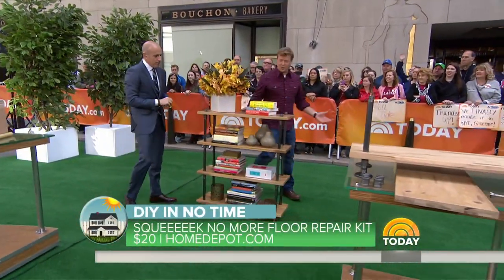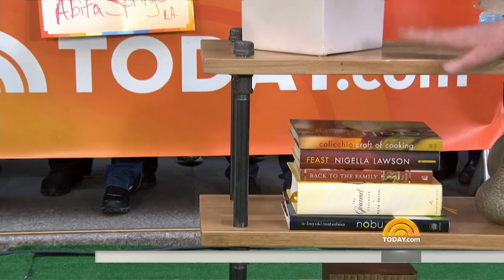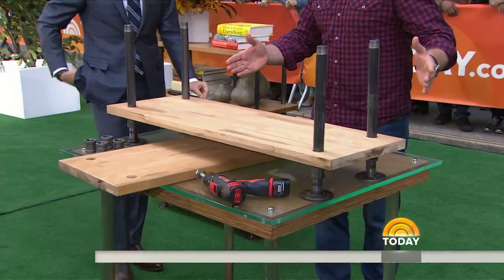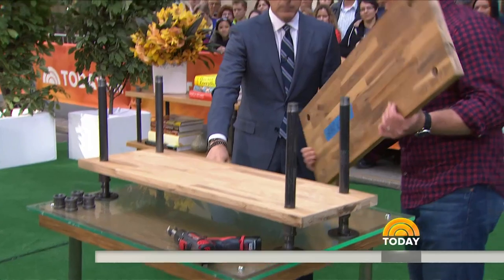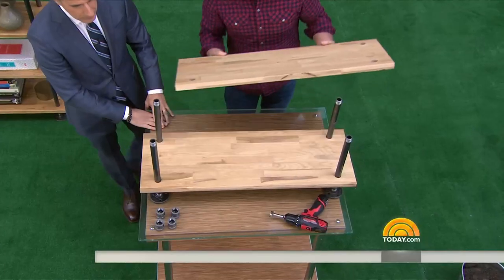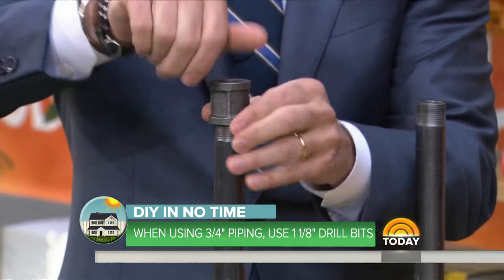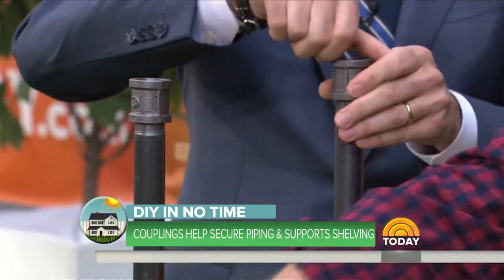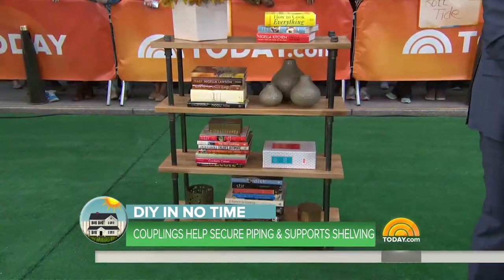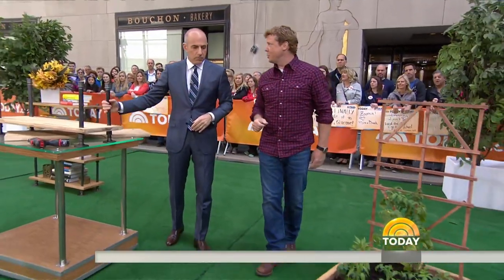Now if we have a day — this is a bookcase right here, and it's kind of cool because we're using steel pipe for a sort of industrial look. For about $100 worth of wood — something like an Ikea butcher block — you don't have to do any fancy joints or joinery. All you need is a circular saw and a drill. You put holes in the four corners and slide the boards onto the threaded pipe. You put a couple of couplings on to join pieces of pipe to raise it up and hold each shelf in place. Then you add the next shelf and repeat the process — you could do four, five, or six shelves. You're talking about $100 worth of wood and maybe $30 worth of pipe.